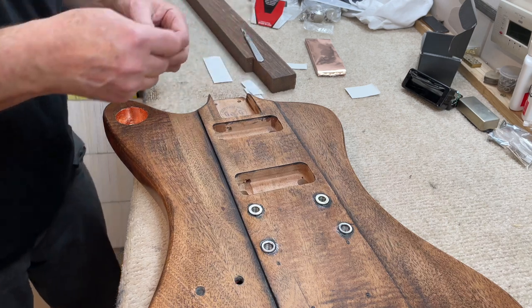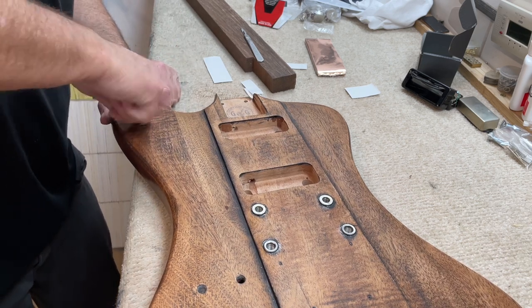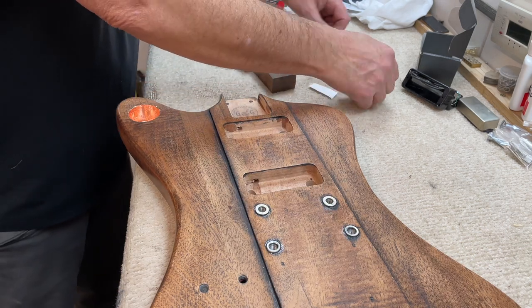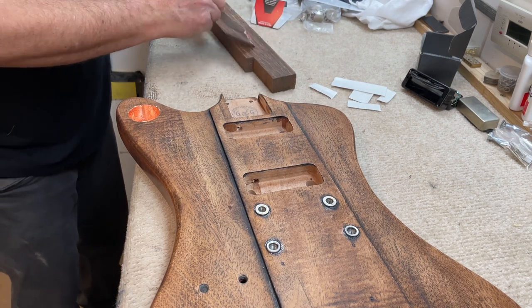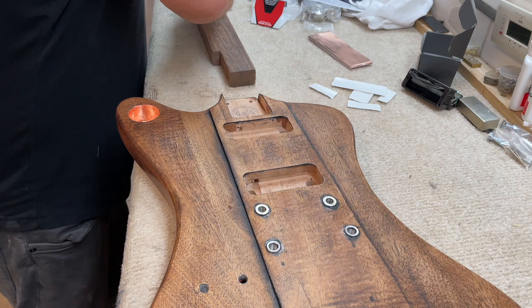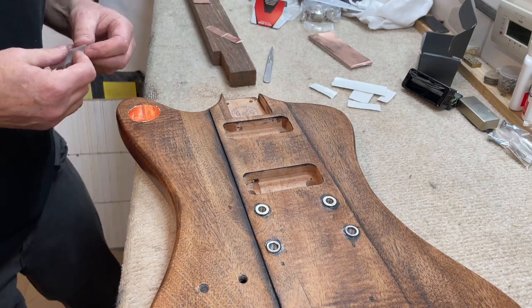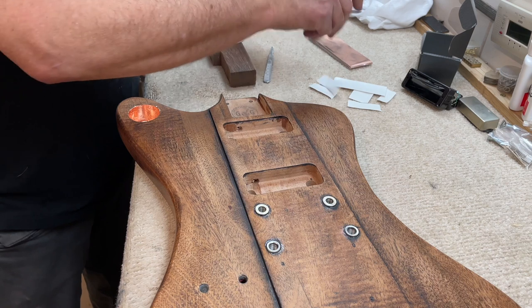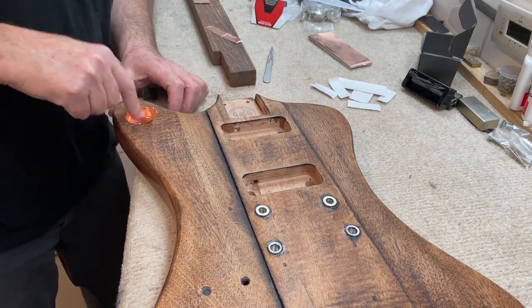And quite often when I've got a switch that I know is too tall, let's say we've upgraded a switch in a cavity that wasn't really made for that type of switch, you can run the risk of it grounding out. So a clever thing to do at that point is to put some, what would you call it, insulation, so some tape down that acts as an insulation, and that will prevent the lugs of the switch hitting the shield. And that's quite common when you upgrade things in Chinese factory type guitars or kits. They're often built for a small component or a shorter switch.